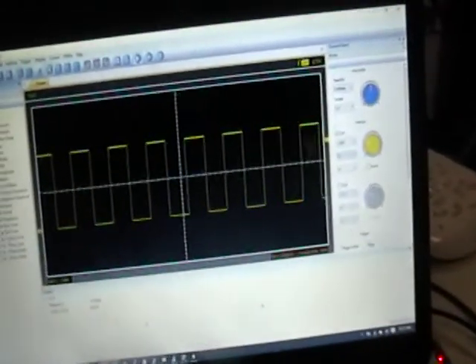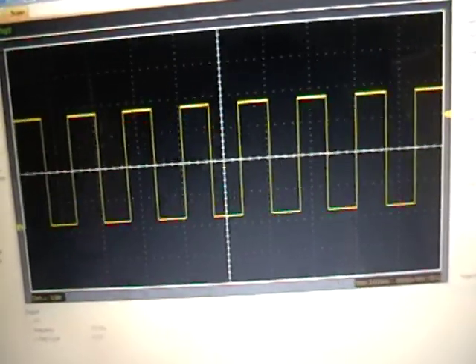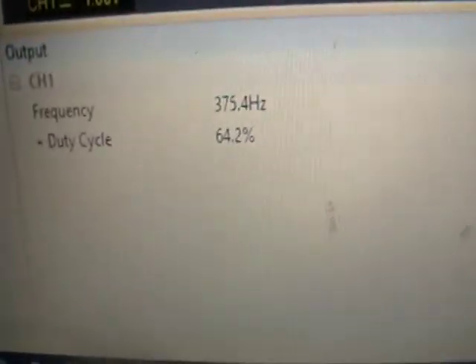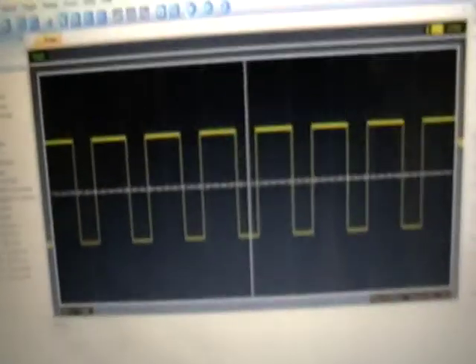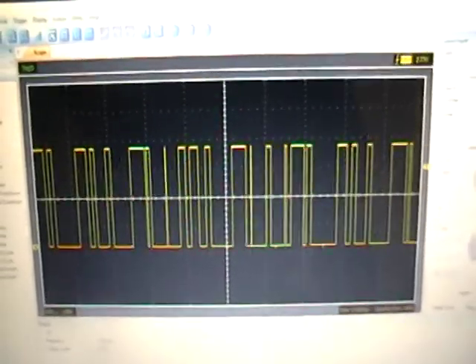Let me grab my controller here. As I move the throttle, you'll see the pulse get wider. As I move it, you can see the pulse gets wider — right now it's about 65%, and that's forward. Then as I go back and reduce throttle — move the joystick down to a less than 50% duty cycle — that's actually reverse. I'll give you a little demo of that in a minute.